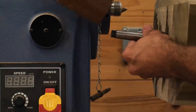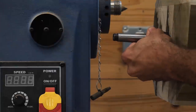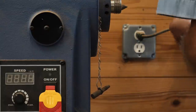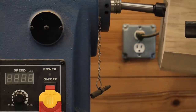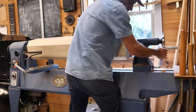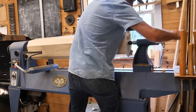The next step is to get this thing up on the lathe, which wasn't really super easy. The first thing I did was hammer in the drive center to get it locked in position — and I totally forgot and dropped it, which kind of shows you how difficult this was. The thing's not very light. Once I got it picked back up off the floor, we got it into the headstock. Working with two hands, trying to hold it up and get it centered — that's the key, because you want this thing to be balanced.